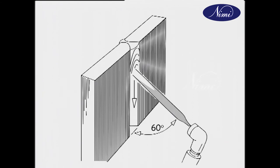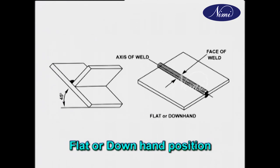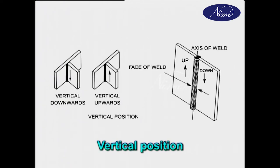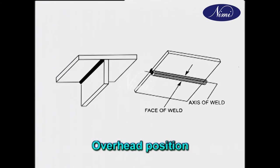The position of the welding joint line and the weld face with reference to the ground axis indicates the welding position. The basic welding positions are: flat or down hand position, which is the normal horizontal position of welding; horizontal position, a technique where the line to be welded is kept parallel to the welder; vertical welding, where two techniques are available for up and down welding — the up technique is used for heavy sections and large fillets where root penetration is very important, and the down technique is usually restricted to lighter sections and joints where penetration is not a problem. Overhead position is usually done in site welding for building construction and structural columns.